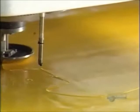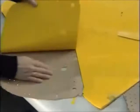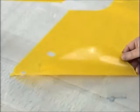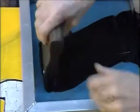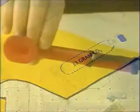To make a life vest, a computer-controlled knife cuts a pattern in urethane-coated nylon. Heat from the blade makes some pieces stick together, so a worker peels them apart. This shiny side is the waterproof coating — it'll be on the inside of the life vest. They place the front of the vest on a vacuum table to hold it down, then silk-screen the amount of carbon dioxide needed for inflation onto the fabric.